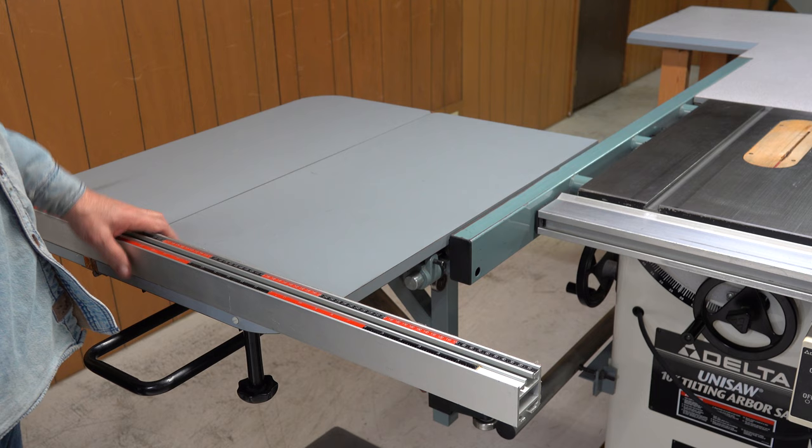Number 56 we'll call a piece of helper stock. This here. If you don't use that, and you just cut off a small part, the part falls away and doesn't end up having a perfect 90 degree at its edge, because as it's being cut off, there's a little nib that's left over. If you put a piece of helper stock behind and then run this through, make sure your piece of helper stock is considerably taller than the part in front of it, otherwise it'll be cut off too.